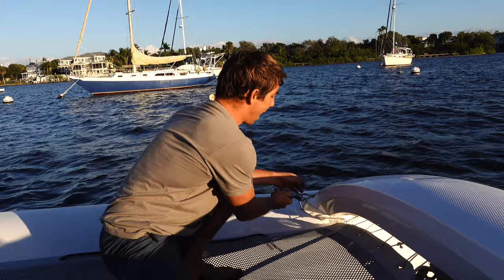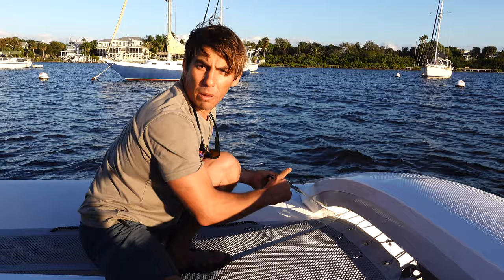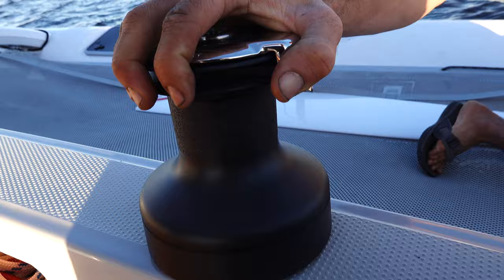And speaking of the bigger head sails, we talked about the screecher real quick. The spinnaker basically just has two sheets. So you can launch the spinnaker on the tack line and the halyard, and then the sheets on both sides run back to this strap, which has a block on both sides. So this is the outer part of the boat, through this block and then to the winch here, which controls the sheet of the spinnaker. Here's the cleat where you would cleat off the continuous furling line for the screecher.